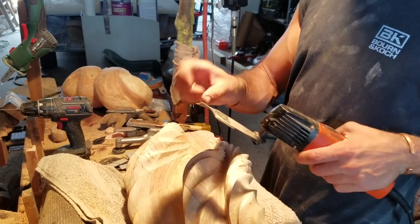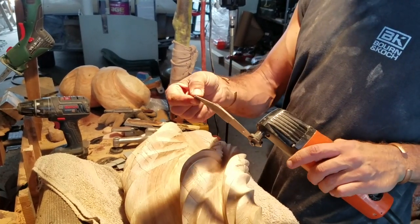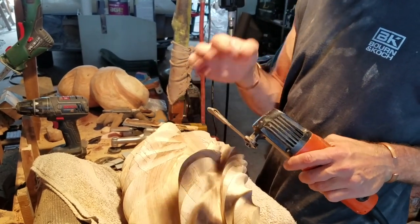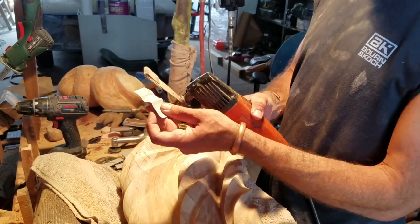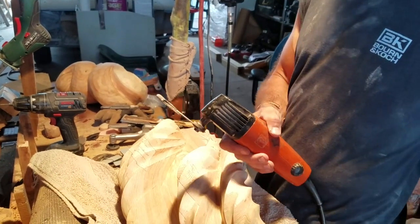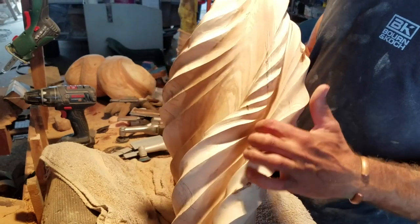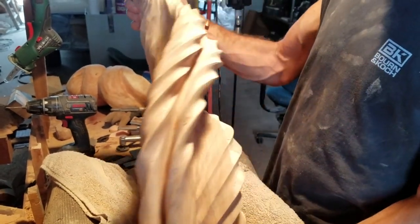So this is a piece of bicycle inner tube or motorcycle inner tube, and I glue that on here with spray adhesive, and then I glue on little pieces of sandpaper. Here was one of them — it's worn out, so I'm going to re-line it, and I'm going to show you how I can sand in here and generate fine lines within a tight spot down there.